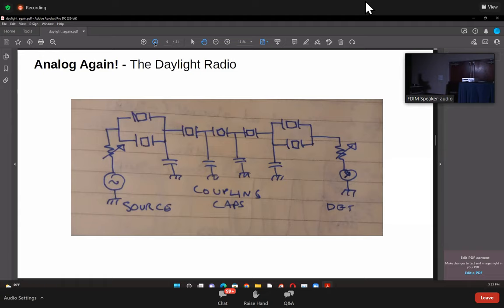At an IF of 11 megahertz, like the ones used in the microBitx, it's easy to make SSB filters, but far more difficult to make a good CW filter because the losses really mount up. Okay, so this filter is called a QER filter. It's very easy to make. There are just two things to remember here. All the capacitors are of exactly the same value, okay?